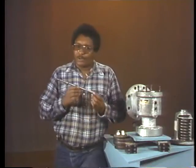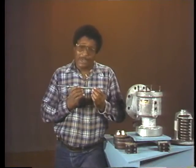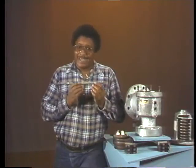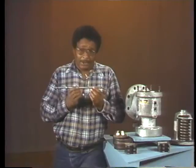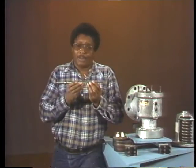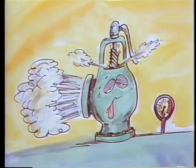The spindle is among the most critical parts of the valve and also one of the most likely to be damaged. The most common type of damage to the spindle is bending, caused either by careless handling or by system pressure pushing upward when the valve opens. A bent spindle can lead to serious valve malfunction — it can prevent the valve from opening, or prevent an open valve from reseating when system pressure drops back to normal.